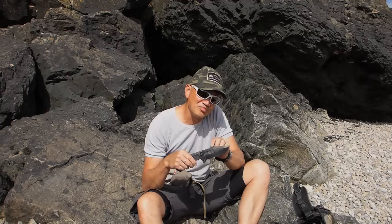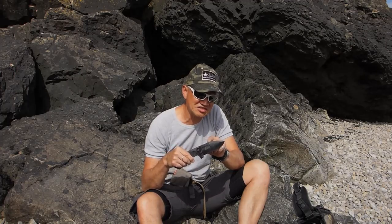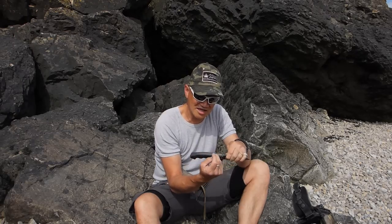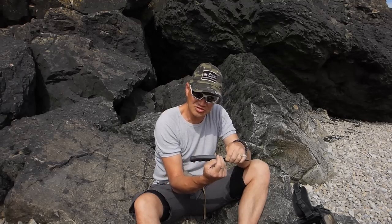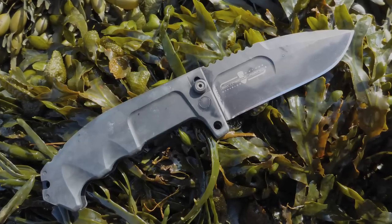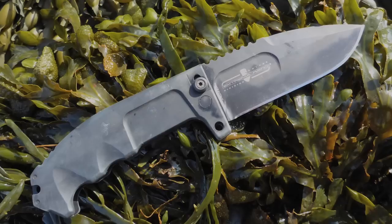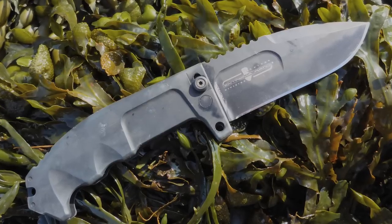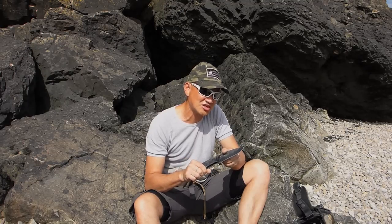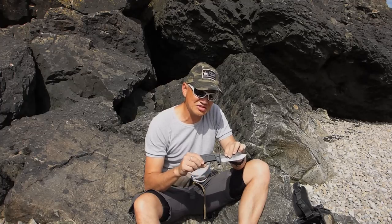Anyway, the blade itself is made from N690 Cobalt martensitic stainless steel, and also this part here of the tang, as such, the handle is also made from N690. Now the handle scales themselves here, this is anodized, black anodized aluminium in a 6000 series. This is 6082. Now 6082 is one of the toughest, it's actually rated as the toughest aluminium alloys in the 6000 series.